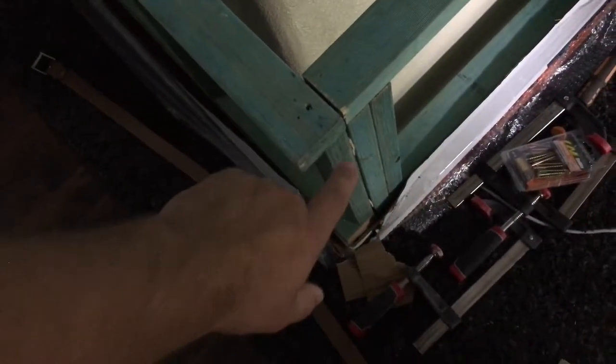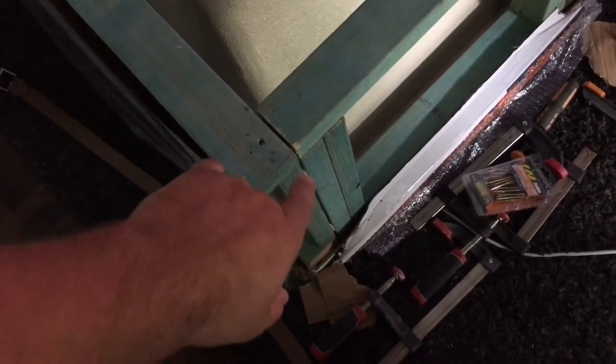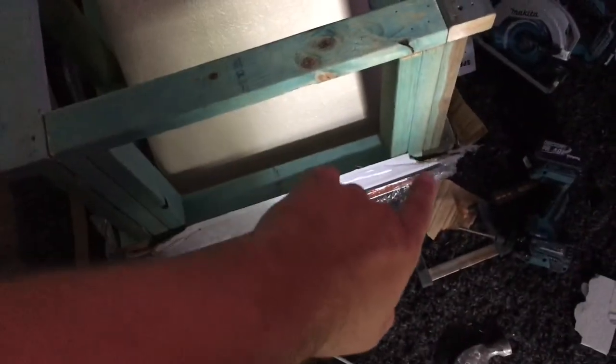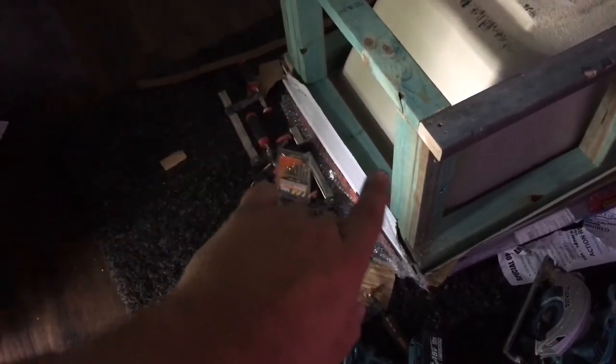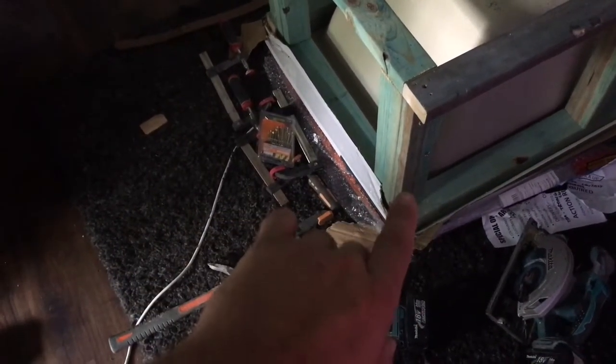You can see how at the ends I had to give it about two mil more, so I just made some packers — just timber crosscut through the end grain — which gives me an extra couple of millimeters. They're screwed in so that piece there is part of that frame and those two are part of this frame, so that's load bearing. There's less than 450 there, and I've offset the screws, which is what you should do. You can see there's a screw there, screw over there, a screw there — you should offset your screws when you're doing anything like this just to keep things straight.